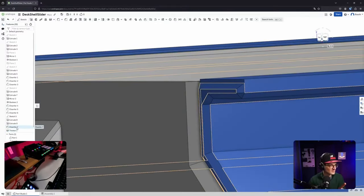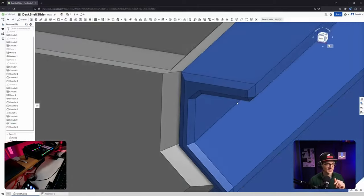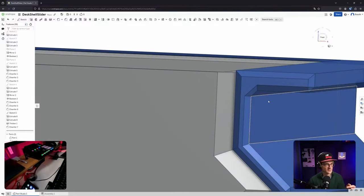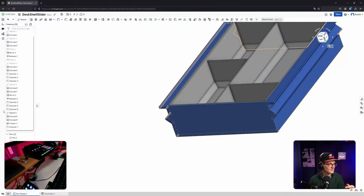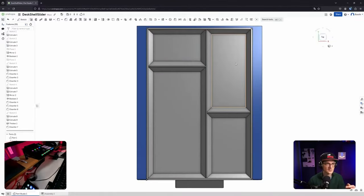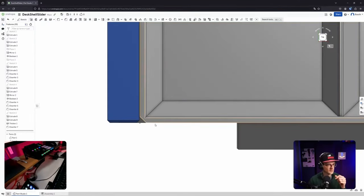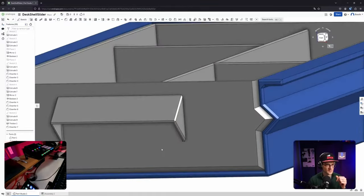It is still, but if we move it one step up... Yes! The chamfer is now affecting after the thickening already, and that's now fixing the problem. Cool. I would consider that the fix the easy way. KISS principle. Keep it simple, stupid. Cool. Moving it all the way back in, that's fine, even if it's standing out a little bit because of tolerances of the printing process. I can't see any big problems anymore.